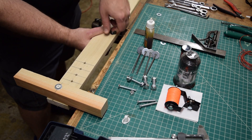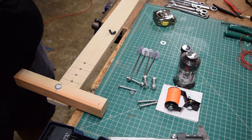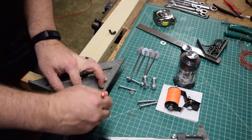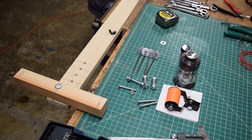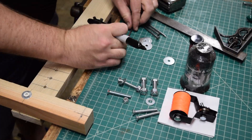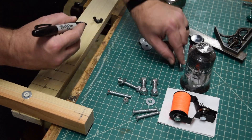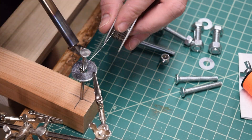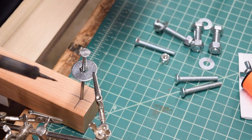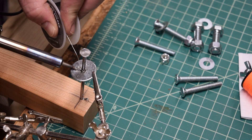I added bolts with nuts near each end to secure loose ends of the string prior to serving. I measured out locations for the pins that would be supporting the string, using the largest nails we have in the shop and driven them 1 inch into the arms. To try to keep things even, I marked out 1 inch on each nail using a sharpie. Using washers on the nails was to prevent the string from sliding around. I tried securing the washers with solder since this was just a prototype — it worked, but was not ideal since I was trying to fill such a large gap. In future iterations, I'll try a different solution for the pins.